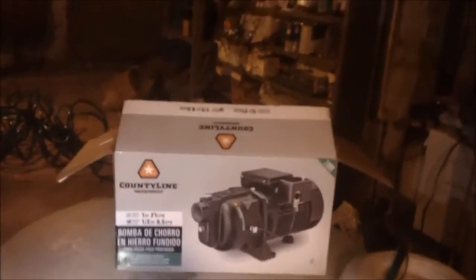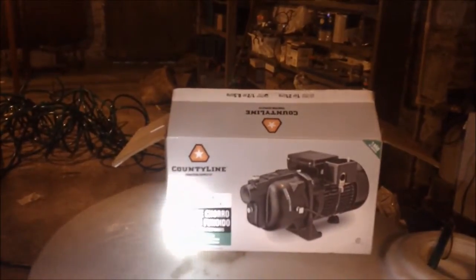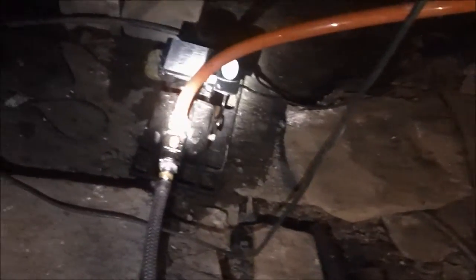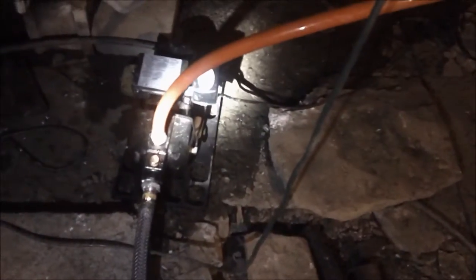Here's the temporary solution. I went and got a pump from Tractor Supply — it's a half horsepower shallow well pump. I just plumbed it right to the pump and into our house well system. We've got a tank there, I put a filtration system in it and I used PEX to connect it. I'm a little bit nervous about how long the line is, and also a little nervous about the pump being below the tank so there's always pressure. But I backed off the regulator and it seemed like it worked fine.